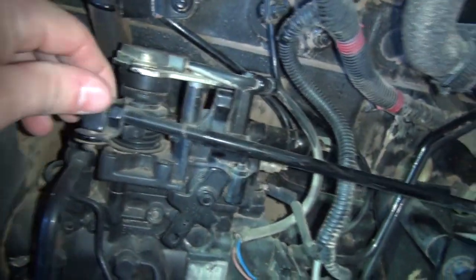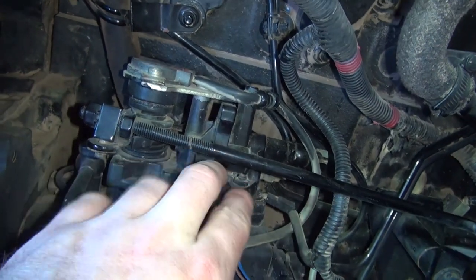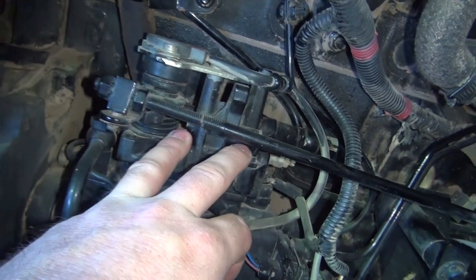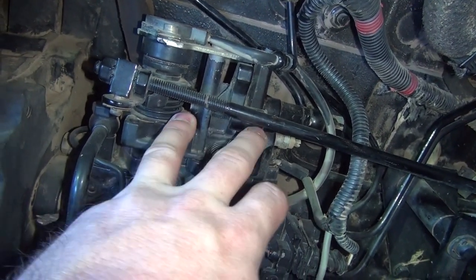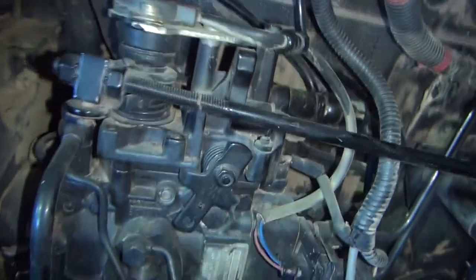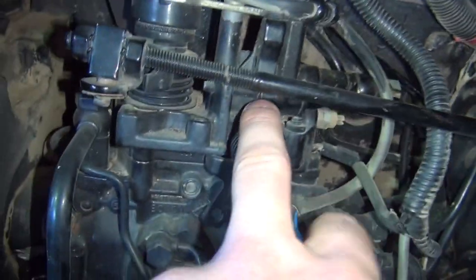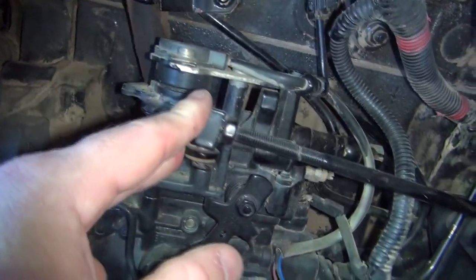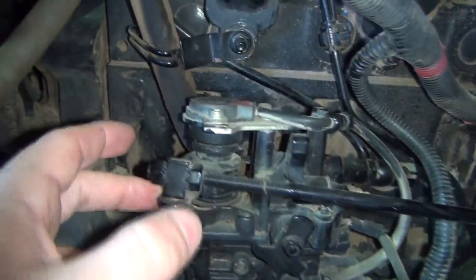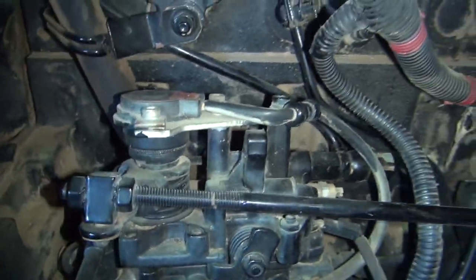I took a small screwdriver on the end of the cap and just gently tapped with a small hammer, got it in there, and was able to pry it off. Then there will be a 10mm nut — there are two of them. One of them is inside here; use a socket and you can pull this little cap off. Then the next one is for your set point. It's actually the one on the back that you'll be adjusting. Don't mess with this front one — this is for your maximum RPM, for when you're running wide open.